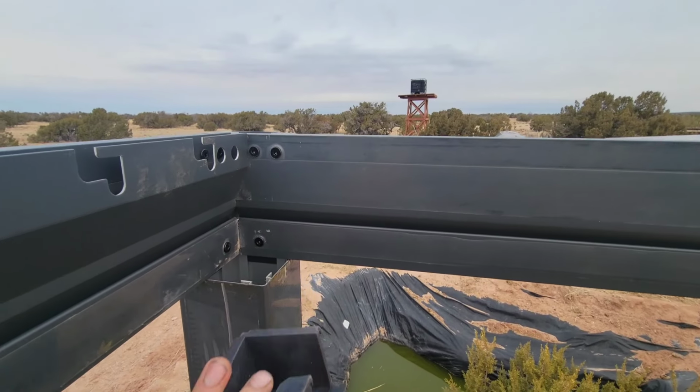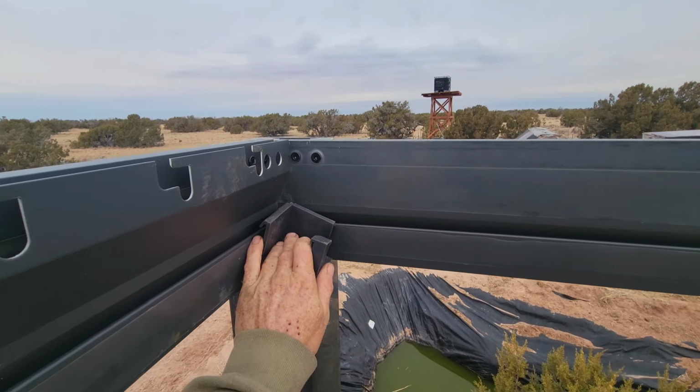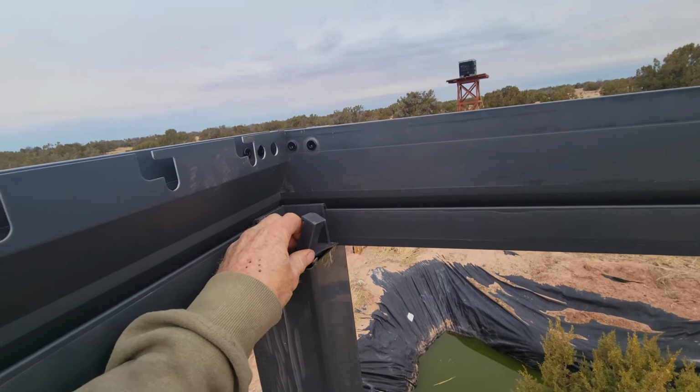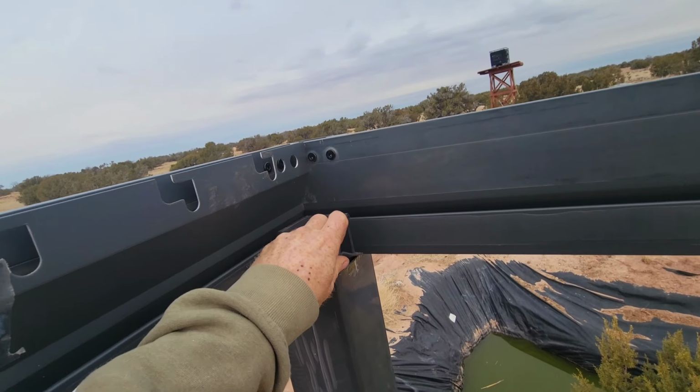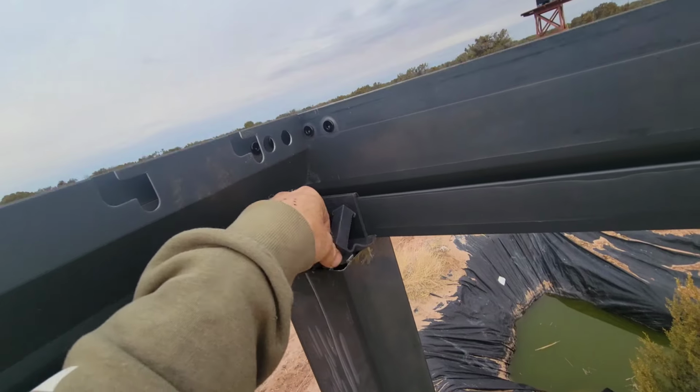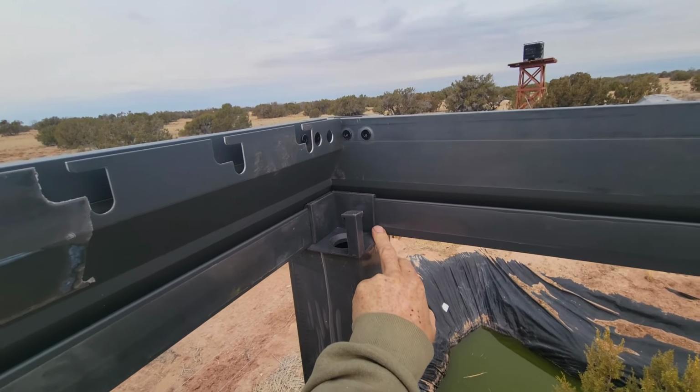Once you've lined up all your gutters, you can just caulk these corners to make sure that there's no leakage, and that way, when your shutters are closed on the louvers, when it rains hard, it's not going to puddle up and fall on you in the middle of the pergola. It will drain to the corners and out through the bottom of the deck.